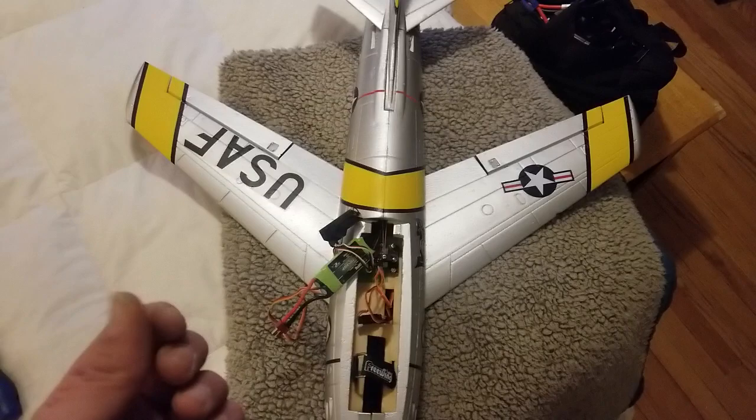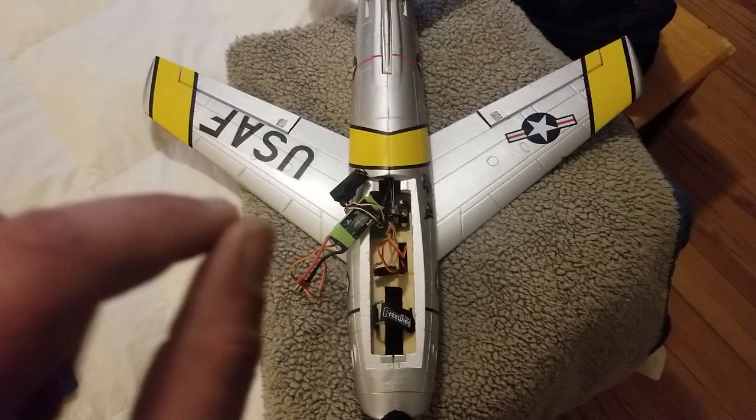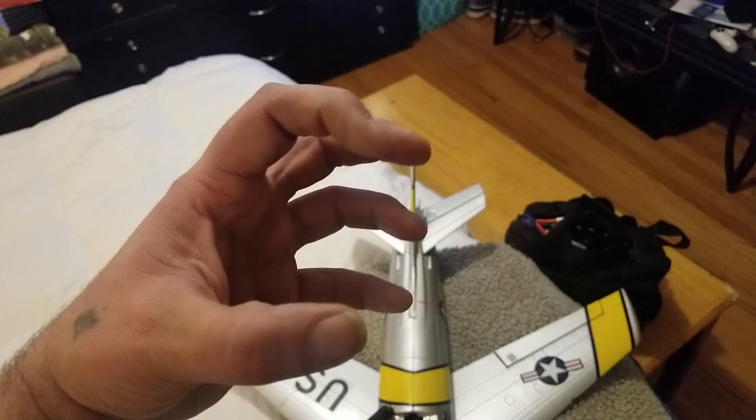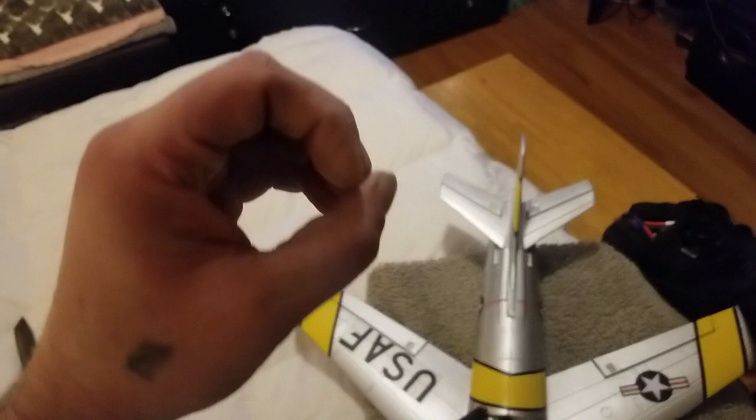It just takes a little longer to set up. You don't want to use too much gorilla glue because when gorilla glue dries it foams up — it does this expansion thing. What that's intended to do is get into all the cracks and crevices that you can't see with your naked eye. That's why gorilla glue does that: it expands while it dries because it's filling in all the cracks and crevices. But that's it guys — almost there, we'll be back in a few minutes. I'm going to check this out and see if everything's going the right way.